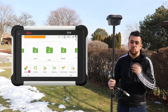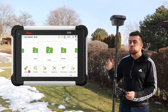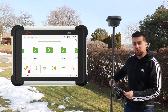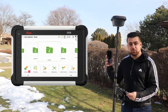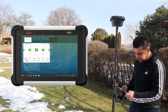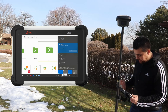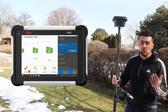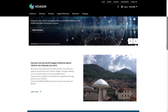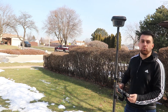With any GNSS receiver we need to connect to a base station. This could be a second static GNSS receiver, or you can use NTRIP to connect to a local CORS network and receive corrections over the internet. You can connect via a phone hotspot or your home Wi-Fi on the CS30 controller. Another option is to subscribe to Hexagon SmartNet, which sends you a SIM card so you don't need a Wi-Fi connection or phone hotspot.